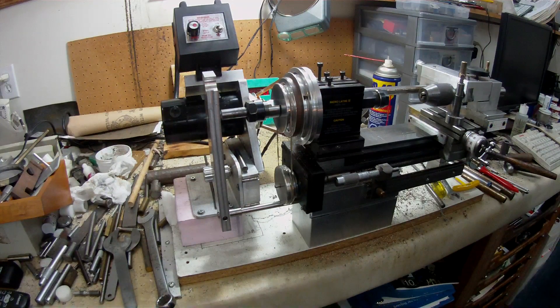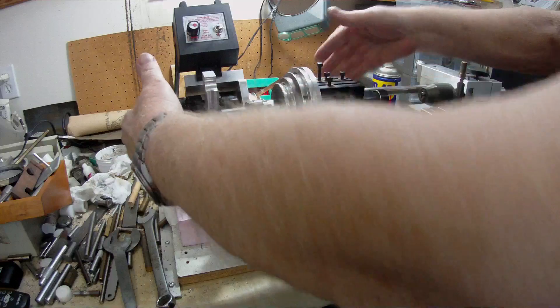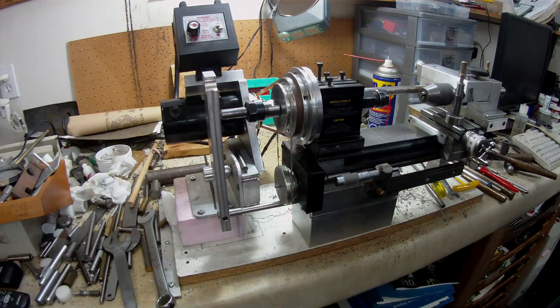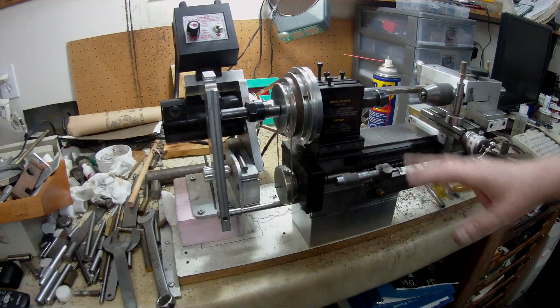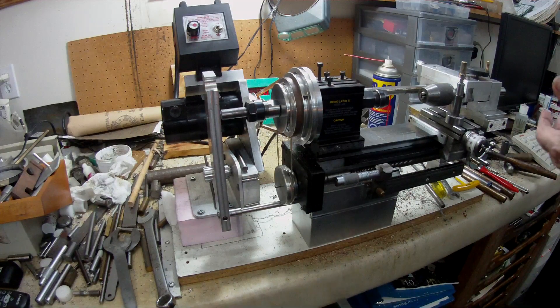I've added a few different features, mainly because of the setup of my lathe and the countershaft drive system. I wasn't able to follow his design with a plate on the back and the 3/8" feed bar attached to the side of the cross slide. So what I've done is I've got my 3/8" bar running through my main assembly block for the lathe, attached underneath the carriage.